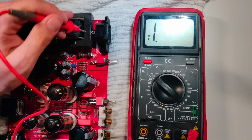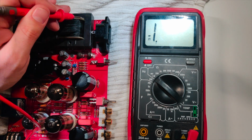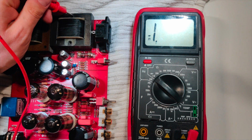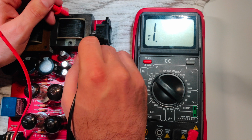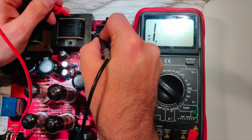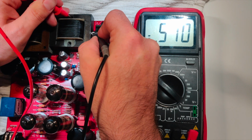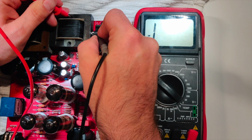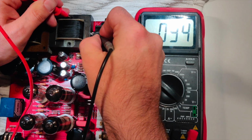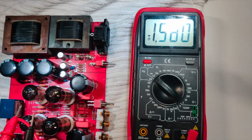This is coming into contact enough with this circuit board, this is coming into contact enough with this transformer here, that if I stick this just up against the core here, and I press on it, if I pull it away, obviously it's not going to beep, but the minute I press it up against, like right there, we're getting only a few ohms resistance between those 2 points. I'm almost wondering if some bouncy ground thing is happening, causing my noise.